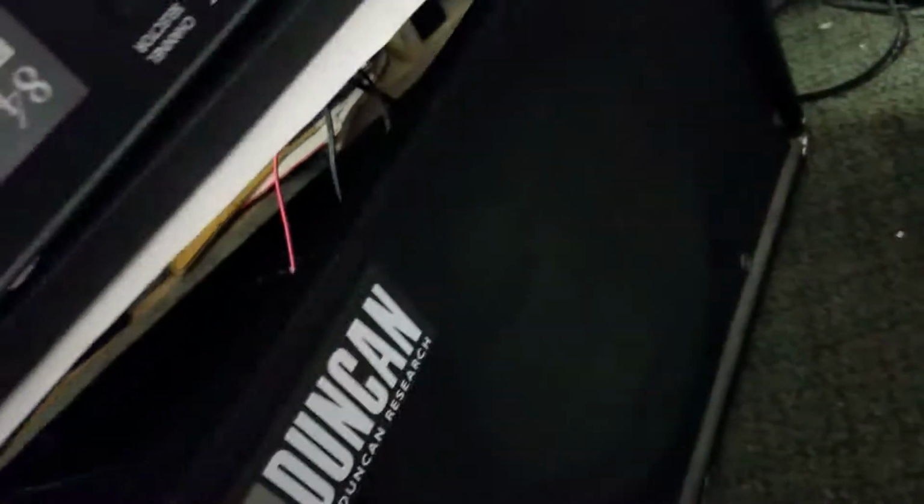Have one more thing to investigate on this amplifier, and that is to find out why that one tube is making a bit of noise. The amp does have tube isolators that kind of hold them in place. I don't want to put my name on this thing knowing that that's making noise like that. I'm guessing there's a bad solder joint on the tube socket. I'm guessing. I have to do that sometimes.